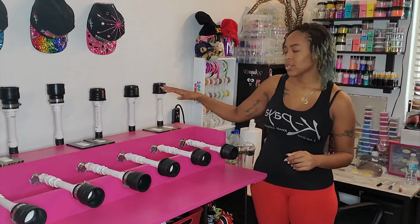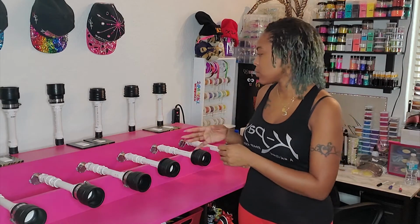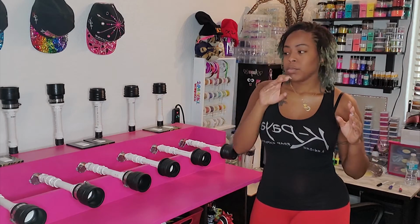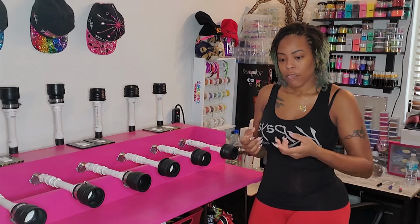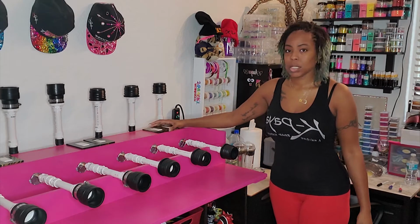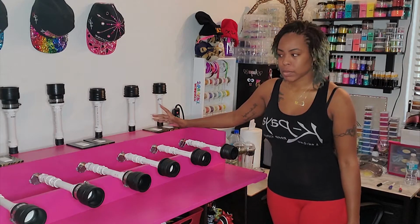All right, so that's it for the motors. Now, when it comes to the cutouts for your switches, I am using smart switches, and I knew that I wanted my switches grouped together in 2s. Some people want their one switch to be horizontal and a switch over each arm. It's completely up to you. Just make sure when you are drilling your cutout for your switch, there's enough space for the box of the switch to sit down in it. I personally wouldn't want it to be snug, so make sure there's enough room. My particular switches needed a cutout that was 2 inches by 3 inches. If I keep looking over here, it's because that's my little cheat sheet. But my cutouts were 2 inches by 3 inches for my smart switches.